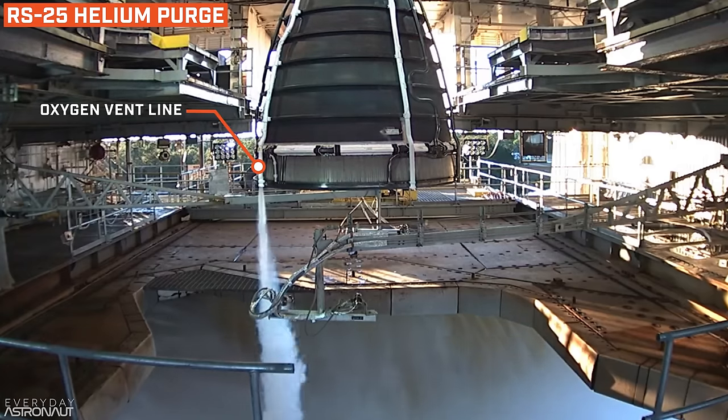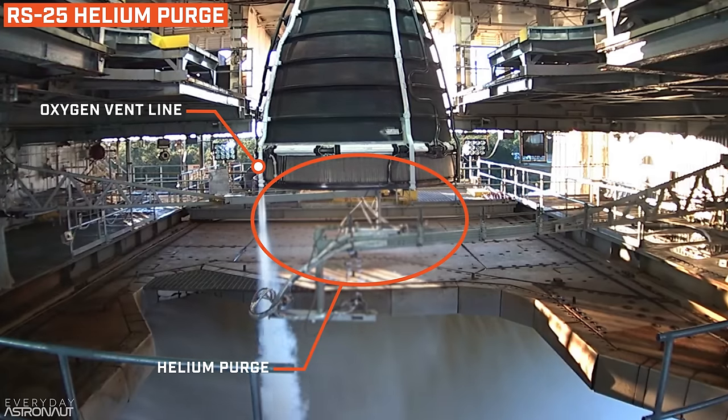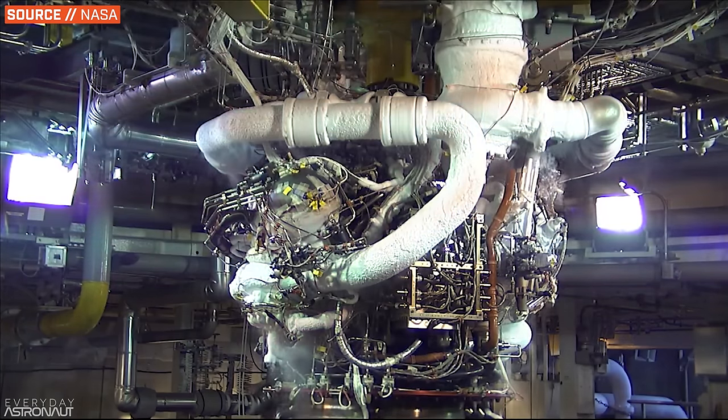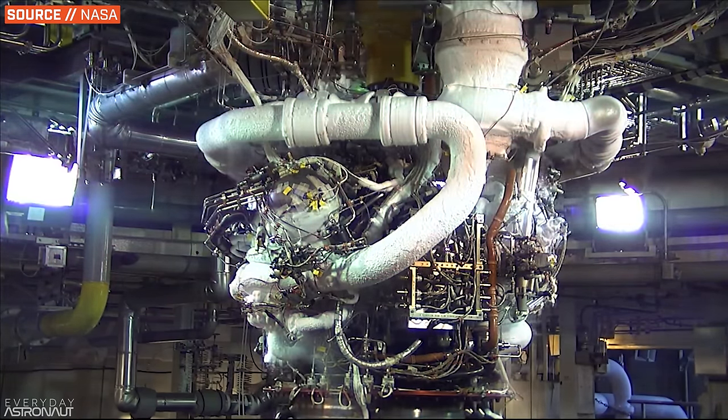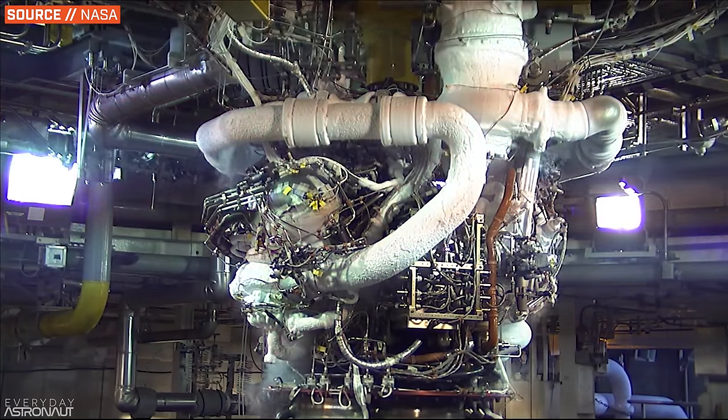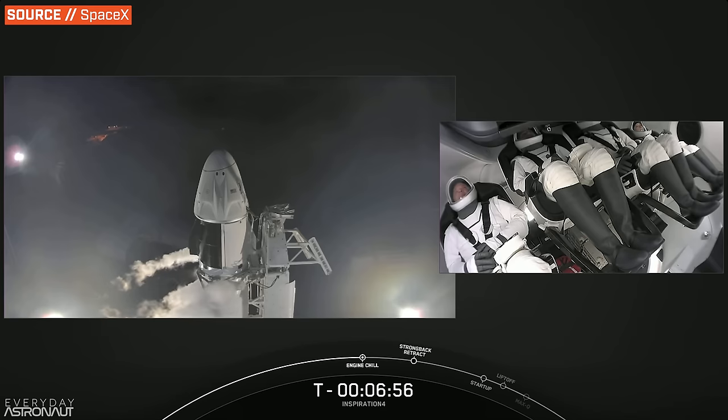Because of this, hydrogen-powered rocket engines are usually purged with helium — the only element with a lower melting point than hydrogen, so in the presence of liquid hydrogen it won't freeze solid. Purging and chill-down of the engines can be anywhere from a few hours before launch to a few minutes, varying very much from engine to engine. So listen for something like 'engine cool down' or 'engine chill down' called out on comms — stage one engine chill has started.